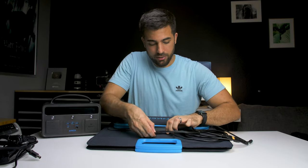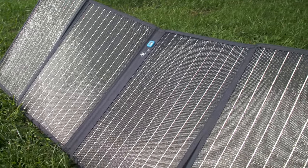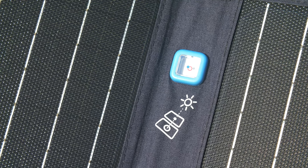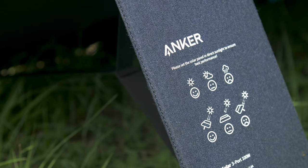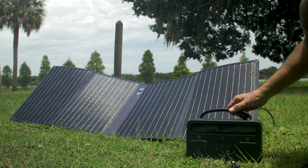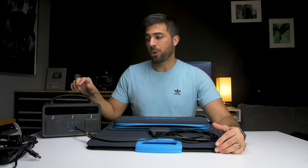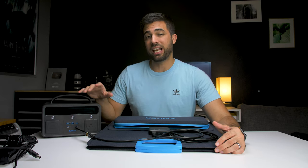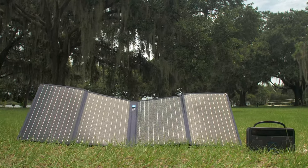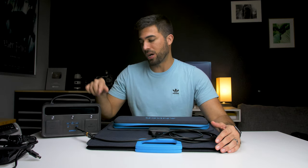You plug in the cable and open up the Power Solar into direct sunlight, because that's when it works best. There's a gauge on here called the Suncast — when the blue dot is in the red circle, the Power Solar captures direct rays for a maximum charge. If it's cloudy or you're not in direct sunlight, you won't get maximum power and it won't charge as fast. When I had the Power Solar in direct sunlight, it was inputting about 60 watts of power into the Powerhouse and said it would take about six hours for a full charge. The solar panel is a great option if you're somewhere for multiple days without a power source.